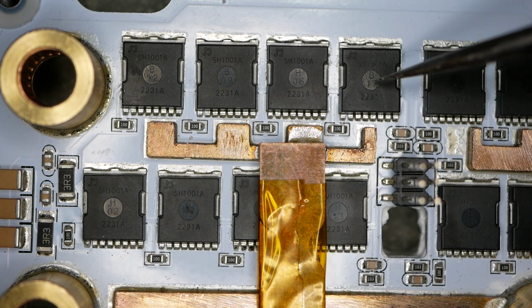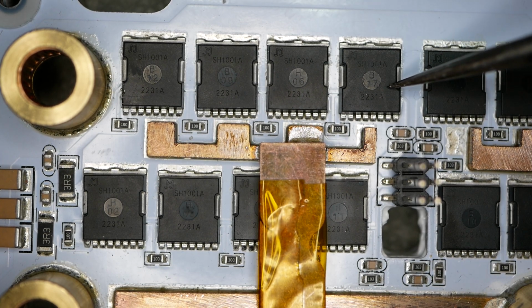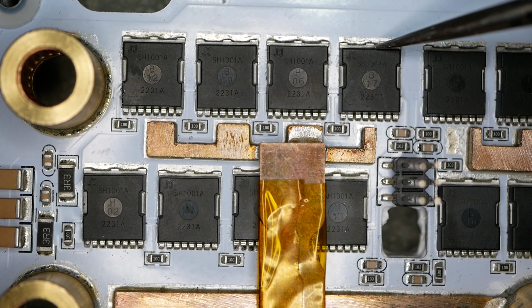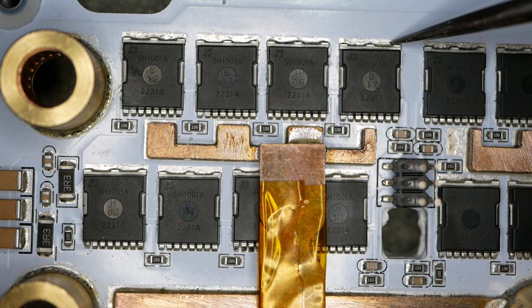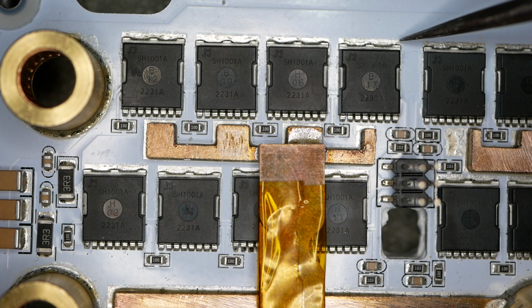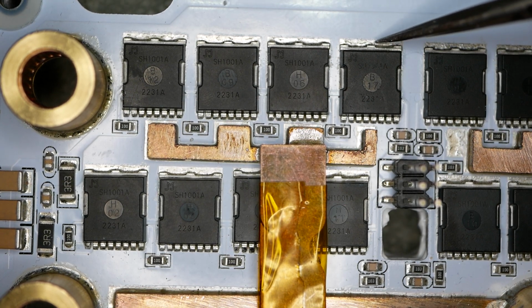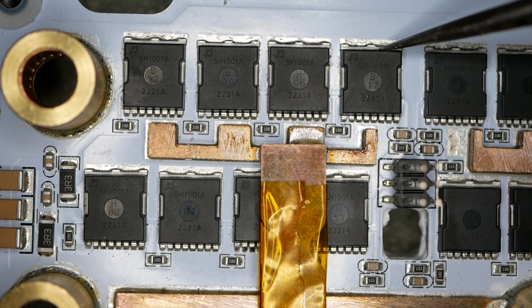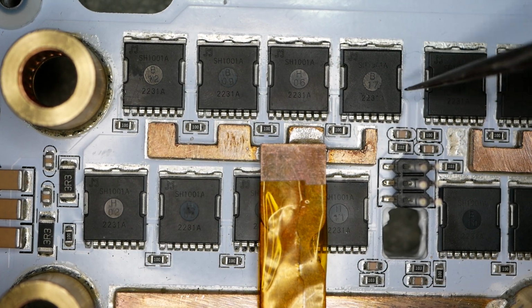What happens is the bad MOSFET is pulled up, another one is dropped in place while the solder is molten, and then you carefully tap it with a pair of tweezers to get it right in place. And when you do that, you pull away the oxide layer a little bit, and you leave shiny new solder behind, and you leave that little line right there. So this MOSFET was a little bit high when it got put on here by hand, and then their reflow guy pushed it down to get it in place. And you got it just a skosh crooked.